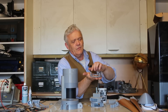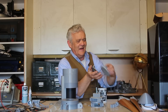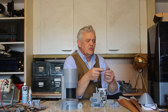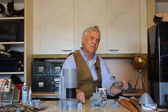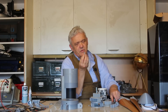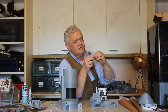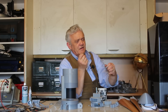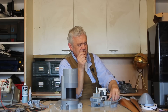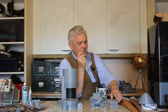When I printed this, I printed it that way and the grain is in that direction, and I did 20% fill. It was not up to the job — it just sheared straight off, and that was so disappointing. There are loads of ways I could fix that: one is 100% fill, two is do something about the grain direction. What I'm likely to do is replace the plastic pins with stainless steel pins — they're 25mm by 6mm, the kind you buy for holding up shelves, about £5 for a dozen. I'm going to reprint the planet carriers, put those in, and probably add bearings, which will make the whole thing quieter and reduce losses per stage.